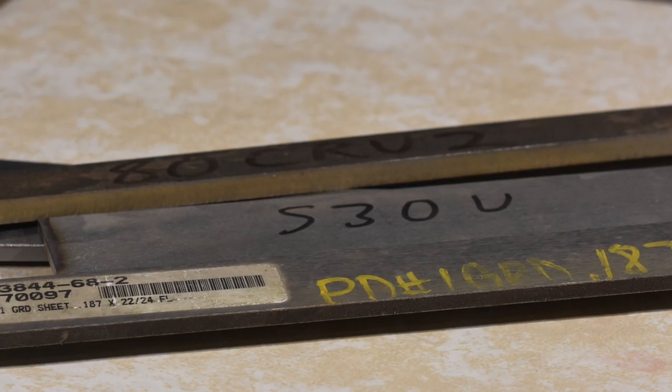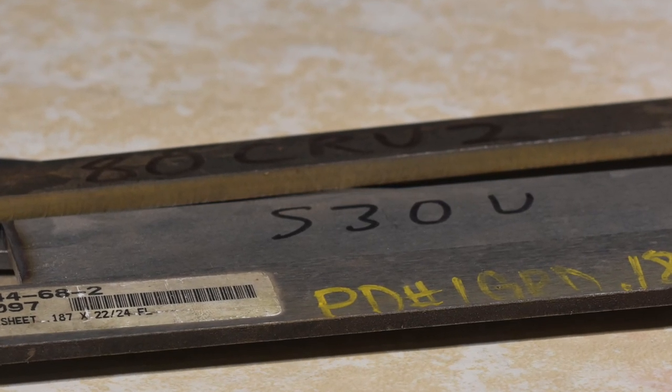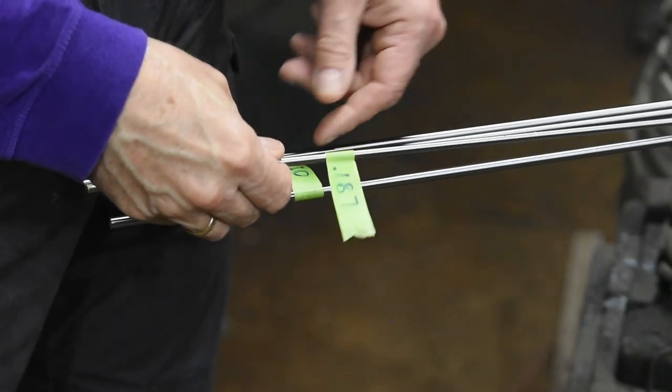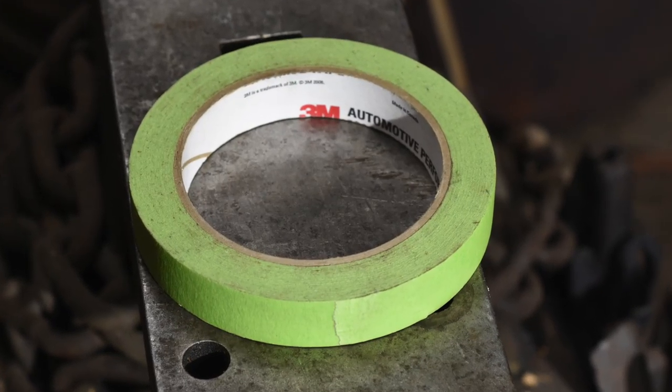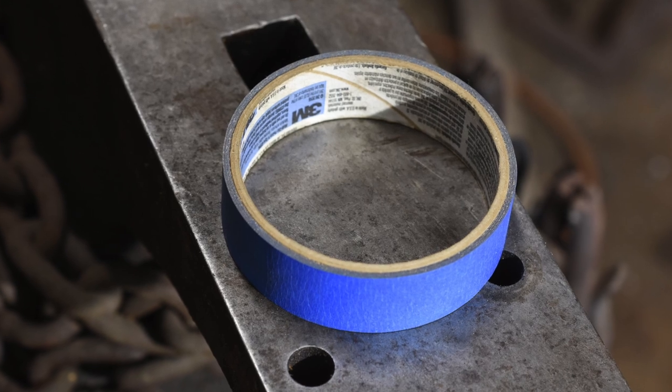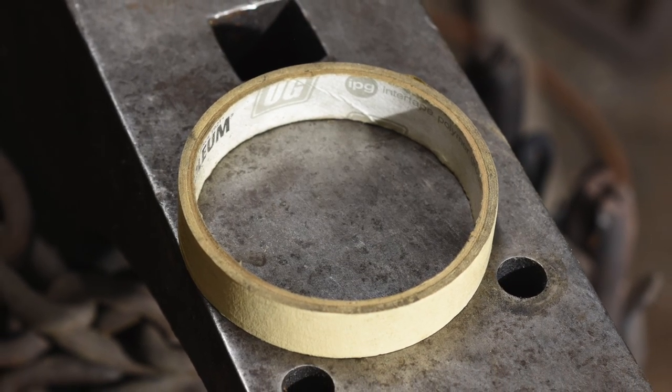Once I realized I had a problem, I started labeling all my steel with a Sharpie, which was fine for a while. But after a couple years, steel starts to rust and then you can't make out the ink anymore — you're sort of back to square one. So the tip of the day: the minute you get a piece of steel, slap a piece of tape on it and label it. I like this green 3M automotive tape. It's got some plastic in it, so even when it gets old it kind of hangs together, in a way that plain paper tapes like blue painter's tape or old masking tape just don't.